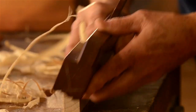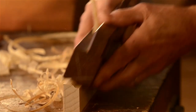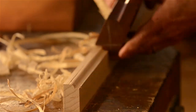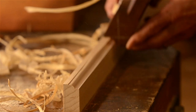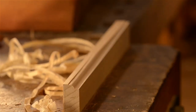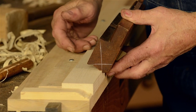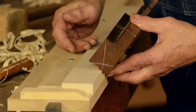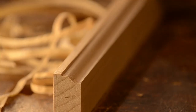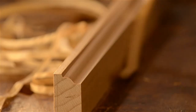You simply line up one of the spring lines to be parallel with your board's face, and then slowly take repeated passes further and further back on the board until you're making full-length passes. Just make sure to keep the plane in line with the spring line the whole time — you can see it illustrated here with white pencil on it. And when the plane stops cutting, the molding is finished.